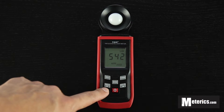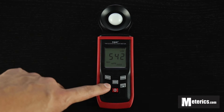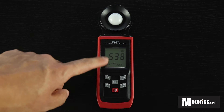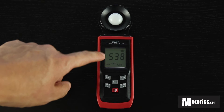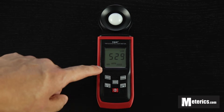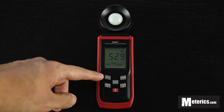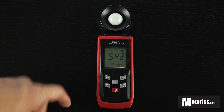The second button is the max button. If you press that once, you will get a maximum function. Press that twice and you get minimum function. Maximum gives you the maximum reading in real time, so any number above this is going to show. And if you're on minimum, you basically get any number below this current reading. Press that a third time and you're going back to normal.